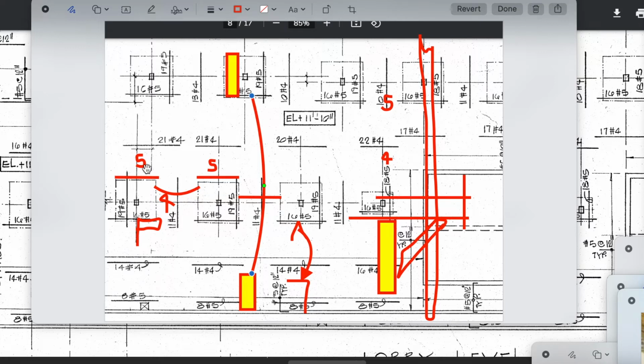And remember, you've got 13, I think, and 12 mixing with each other. So you got some staggered steel here, because I recall, 100% recall, they're saying 13 inches and then also this 12. So those aren't going to line up. No matter how you try it, they're not going to line up ever. They've got to be 12 and 12s or 13 and 13. They could have done 13 and 13 per ACI 1977 code. I do have the book. I have researched that.